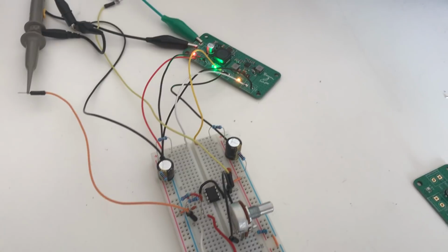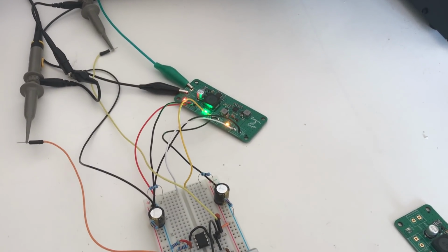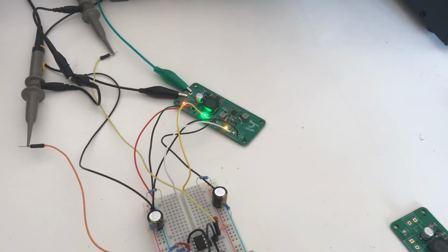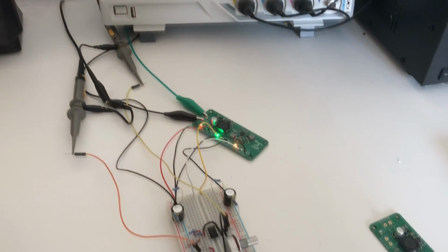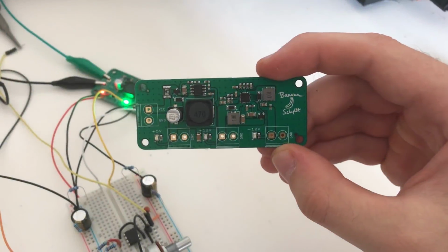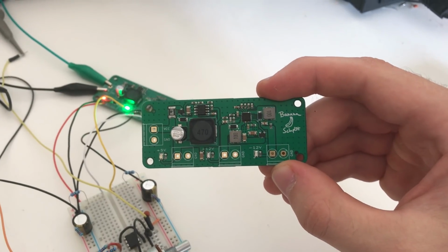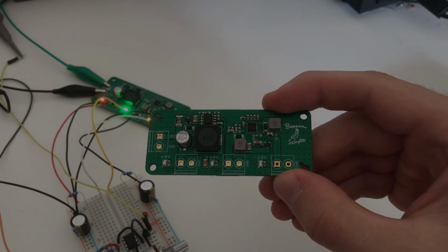We've done a couple more stages in filtering on this breadboard here, but overall with just a tiny bit more filtering, some external resistors and capacitors, we can get this thing really noise-free, which is really nice. So you could even use this for fairly simple and basic audio circuits, as we've done here. So let's move over to KiCad, and I'll show you how I did the schematic, the layout, and the routing for this very simple 2-layer board.